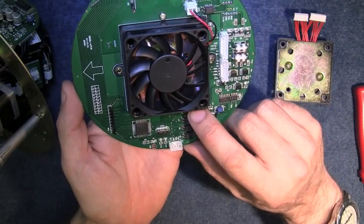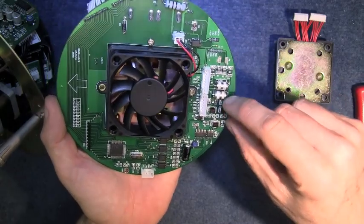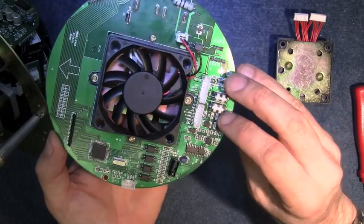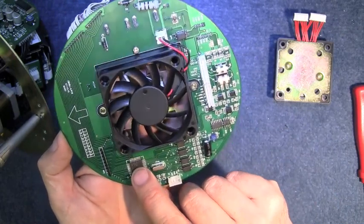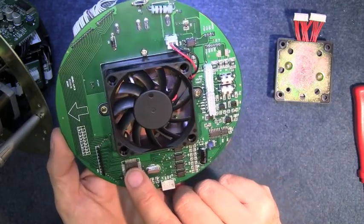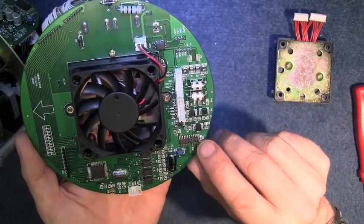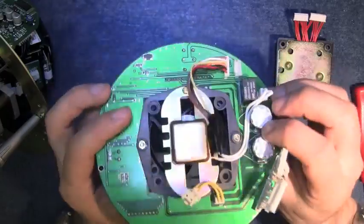On this side we've got some PC817 Sharp optocouplers, another optocoupler, and these look like spark gaps — though I'm not sure about that. There are some little surface mount fuses, an STC chip — I can barely read that — a 74HC14D which is a hex inverting Schmitt trigger, and a 6LB184 which is a differential transceiver. A few more components but nothing terribly exciting.